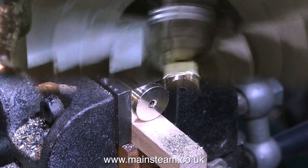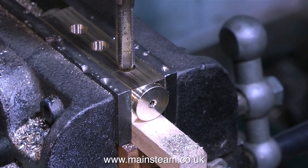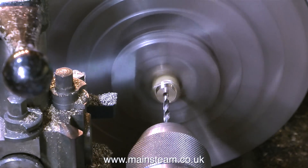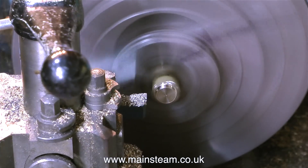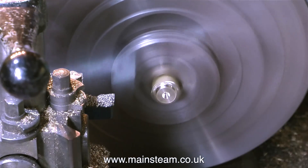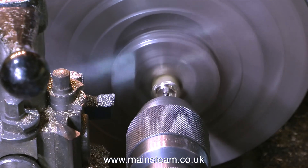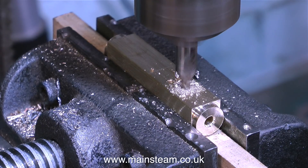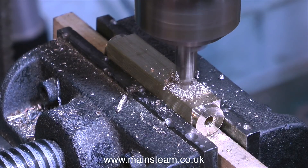I then put the manifold in the drilling machine and drilled three holes, tapping size for 5/16 by 32. When I was three quarters of the way through the tapping operation, I realised that this manifold was hopelessly overscale — it reminded me of the bird tables my father used to make, which were suitable for pterodactyls and elephants, not small garden birds. So it's back to the drawing board. We all make mistakes, said the Dalek, climbing off the dustbin. This time I've selected a smaller piece of brass, half an inch square, which is much more in keeping and definitely more in scale with the Stuart 504 steam plant — a boiler with only a three-and-a-half-inch diameter barrel.